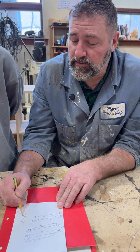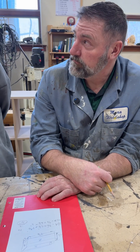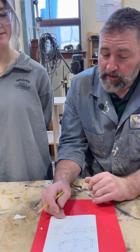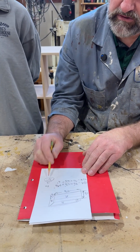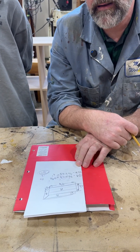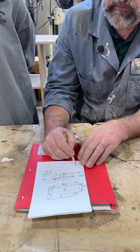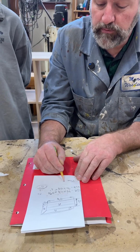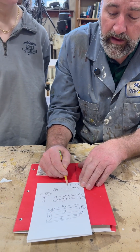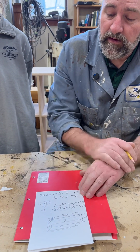She's going to get a 33-inch piece off the wood rack — whatever flavor you want: cherry, maple, oak, walnut, to be determined. She's going to cut a piece 33 inches long. As long as it's six and a half inches wide, she'll be able to take the piece off the shelf, cut it to 33, and we'll plane it first — so I write that down: plane first to three-eighths thick.